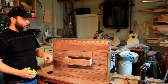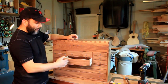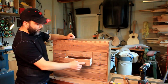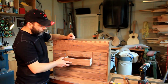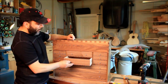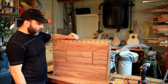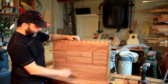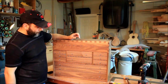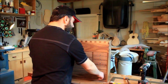So basically, I'm a quarter inch high on this one from the center of the drawer. Like width wise, I'm in line, everything's gonna line up. It's just that this drawer is gonna have the knobs a bit higher. Luckily enough, this side wasn't done. So I'll be able to raise this one as well, so they're gonna at least be the same height. But it's just a reminder that we always have to be careful when we make our measurements, and I'm gonna have to deal with the fact that this one will be off center a bit. As for the other drawers, everything's nice, it slides nicely.